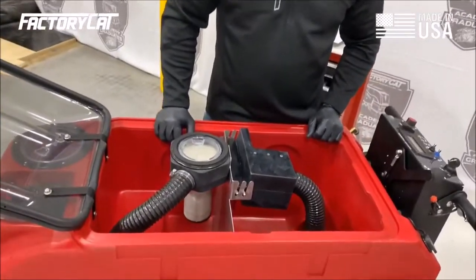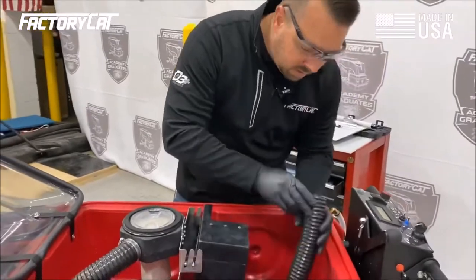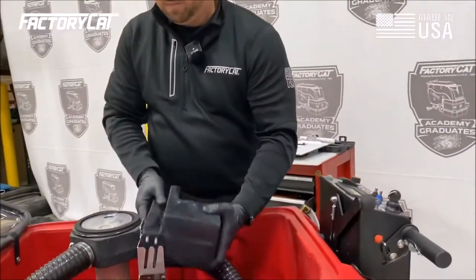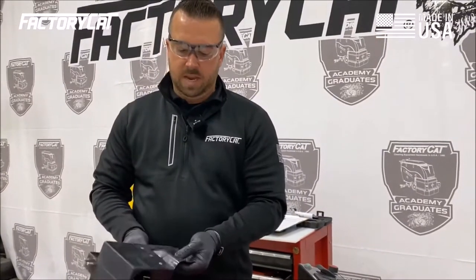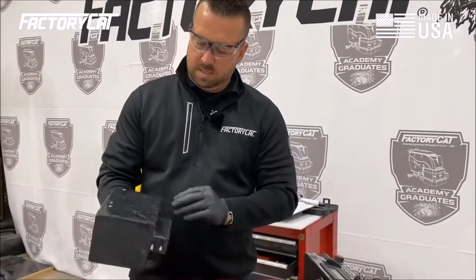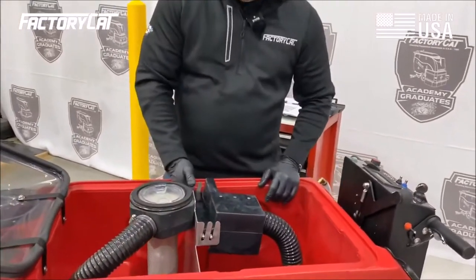We've obviously drained it. All right, I'm going to inspect this hose, make sure that there's no visible cuts or damage. Drain saver basket, pop this out. Going to look in here. Flap is still attached, so that's good. Basket's not damaged in any way. Baffle in the tank looks good.